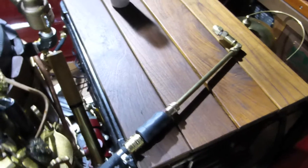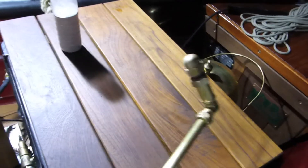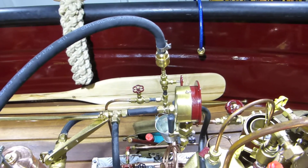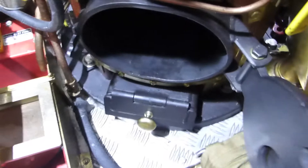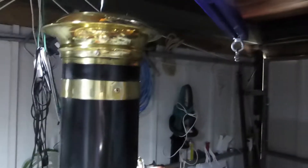In this video I explain how I clean my boiler — the fire tubes inside. I built this small device made from spare parts. It has a very small nozzle of two millimeters on top, and steam taken from a steam line is blown through this device. I then go into the fire room, open the door, insert the piece inside, and clean the fire tubes. All the ash and soot is blown out of the stack.